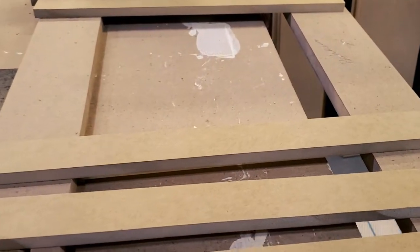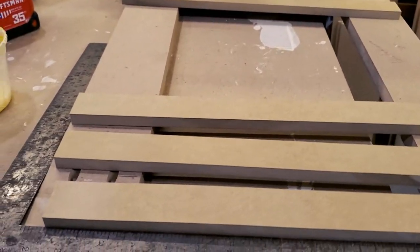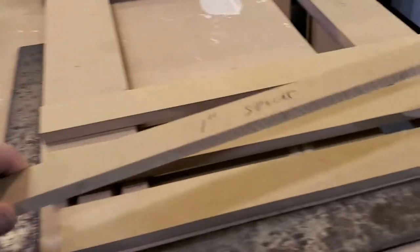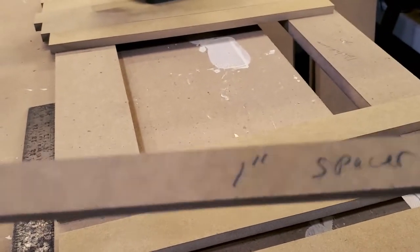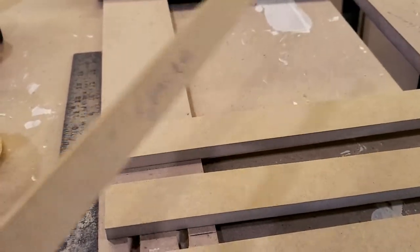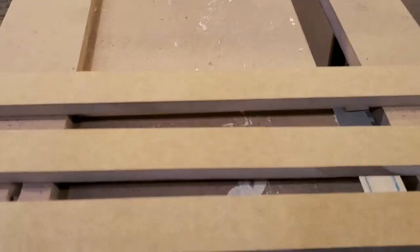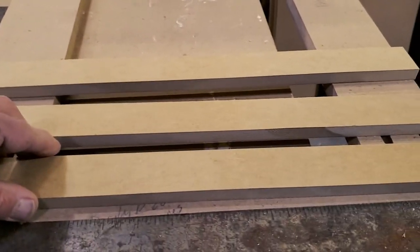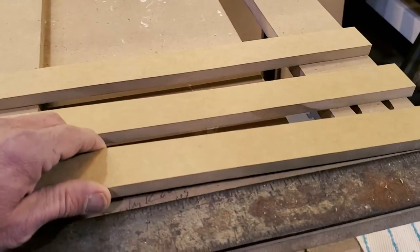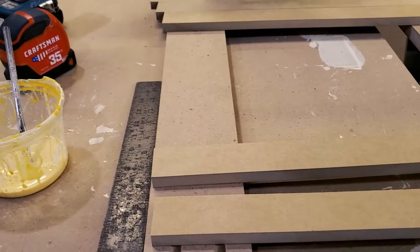This is a crucial point because aesthetics rules all. I'm using a carpenter's square and a one-inch spacer cut out of scrap wood. I label both sides because more often than not you grab the wrong piece, so always label both sides. I did a dry fit and figured out that I need a quarter-inch reveal of the slat on either side in order to give me equal spacing across the whole front of this particular size radiator cover.